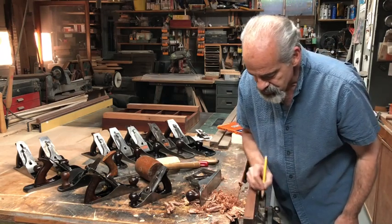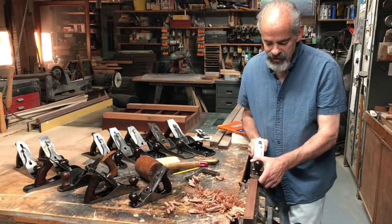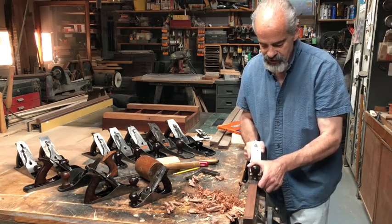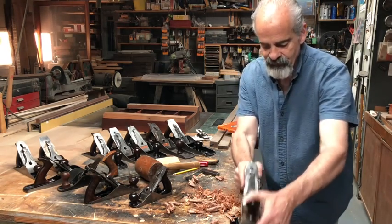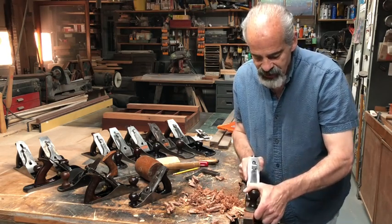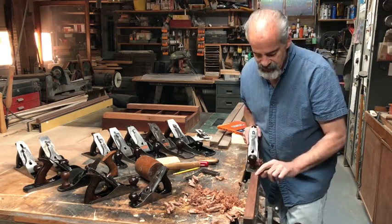I get it back in the vise. I put some pencil lines across it — that'll show me what part I'm taking off. Now I'm going to hold the plane at an angle rather than flat and take off a little bit on this side. What I'm doing — I'll exaggerate for you — is I'm planing like this, tilted, just raising it enough that I start to put a small chamfer on this high side. Once I get that coming down I can see how much I'm cutting by watching my pencil marks disappear. Then I come in and start flattening it out, just taking off the high side. Each time I do it, I bring the plane down flat.